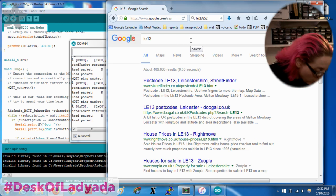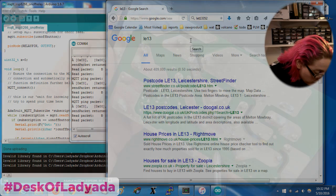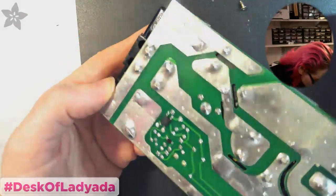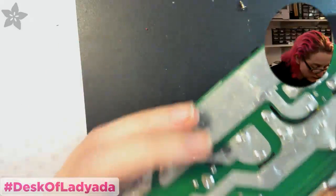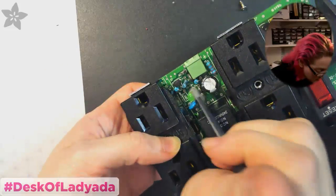No, Postcodes. I don't know what this is, but I think this might be because it's called Opt1. It's probably an opto isolator. Maybe? I don't know. I can look in the specs to see if they mention opto isolation, because that would explain why it's called ISO 1.